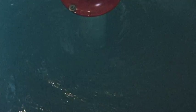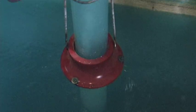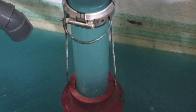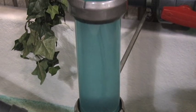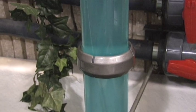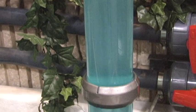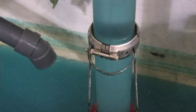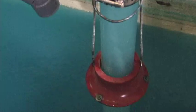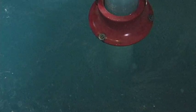We can even see up the suction line. If you look up the suction line here, you can see that vortex working its way all the way up the suction line back into the pump, where atmospheric pressure has now forced its way through the surface of the liquid and is working its way all the way up into the pump casing. The pump's going in and out of a prime — partial prime. It'll lose the prime for a second and then pick it back up.